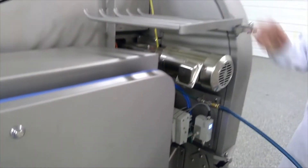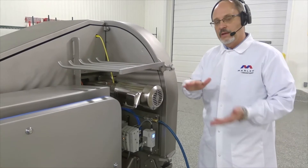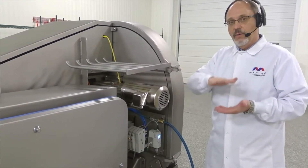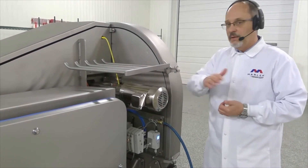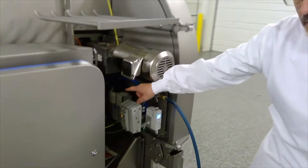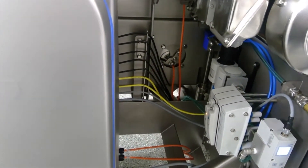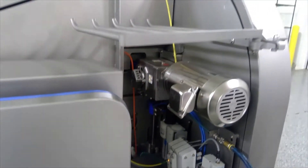This machine operates on compressed air as well. That's what raises and lowers the upper conveyor. We can adjust that upper conveyor pressure for soft product — to where we're just barely touching the product — or we can push down with 85 pounds of pressure on top of the product, and everything in between. We can see how we have managed the cables back here. They're all separated in a loom so that they're not bundled together and won't be a possible bacteria harborage.